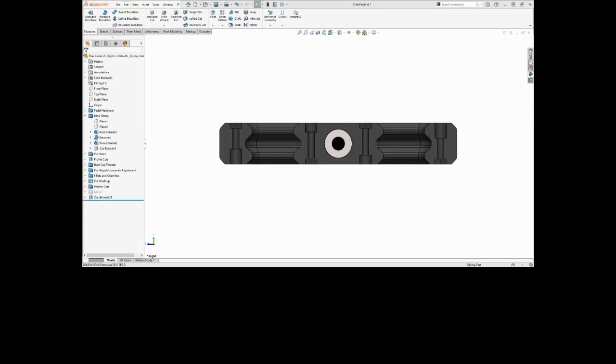This would introduce a lot of support material, not a great surface, etc. So what I ended up doing was adjusting the depth of the socket head clearance hole. And what this does is it allows the pin to protrude out of the back of the pedal more or less. And you can actually adjust this to have no concavity, more concavity, less concavity, etc.